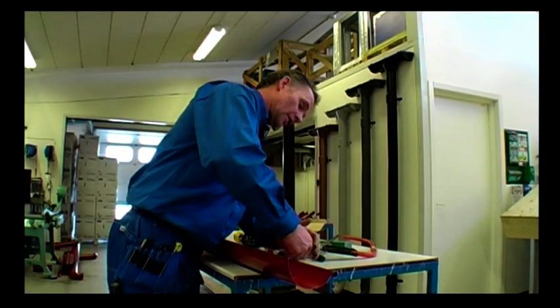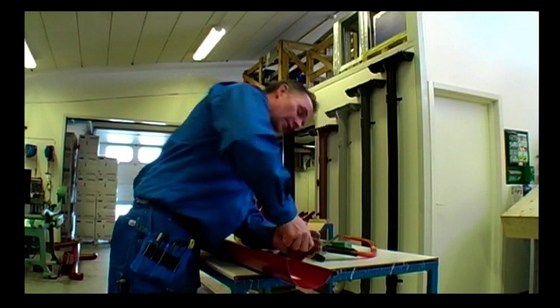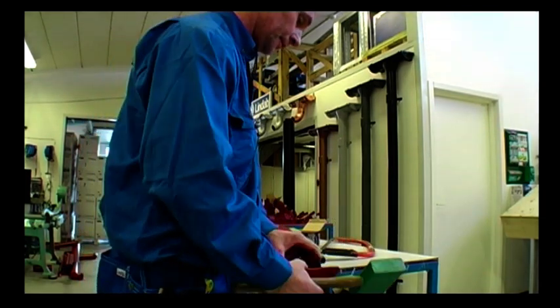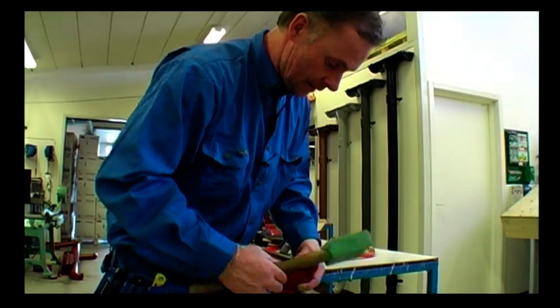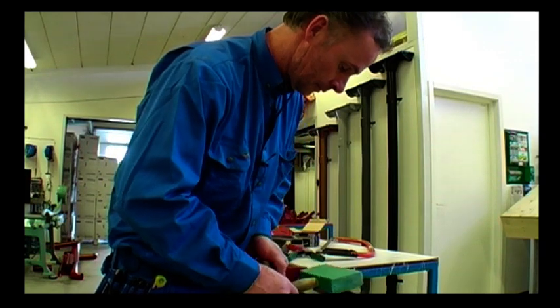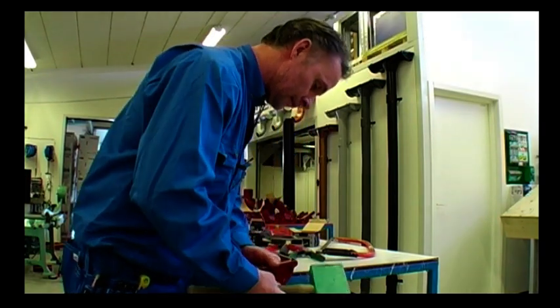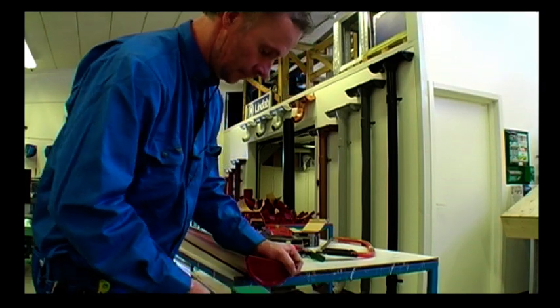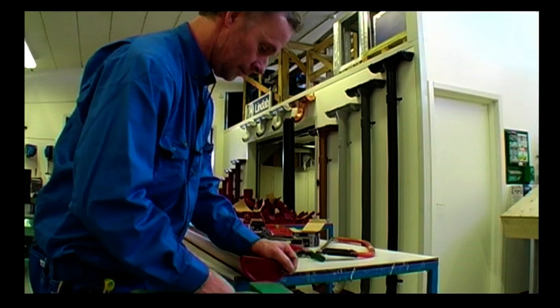I bend the lug that I don't need. Our roof drainage system has self-locking universal stop ends. Stop ends that fit both the left and right sides, which you can easily install on location by placing the stop end against the edge of the gutter. Then tap the stop end carefully with a hammer so it attaches firmly to the gutter.